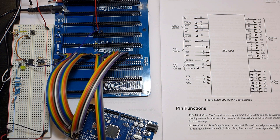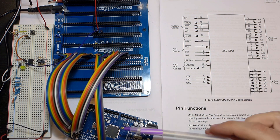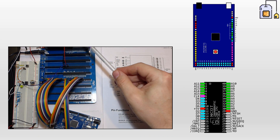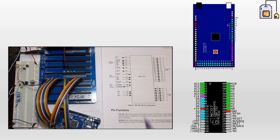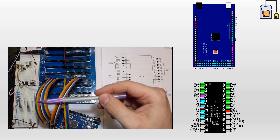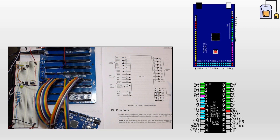Now the boards are all connected together. I've got the Arduino connected to the backplane, the CPU is in its socket in the backplane, and my clock generating circuitry is also connected. To go through how it's connected: this is the address bus on the Z80, going from A0 to A15, which goes through this big fat cable here onto Arduino pins.